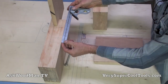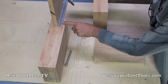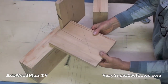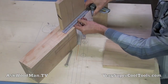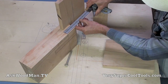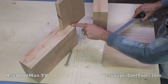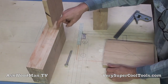That dimension right there is one and a quarter off the bottom. And let's see what it is off the top — this line here represents where the connector is going to go to — so that dimension is two, meaning it's going to be three and a quarter from there, and about two and nine sixteenths from this shoulder here. So when I drill this out I'm going to have plenty of meat here.